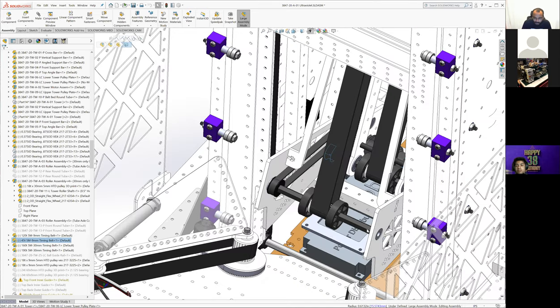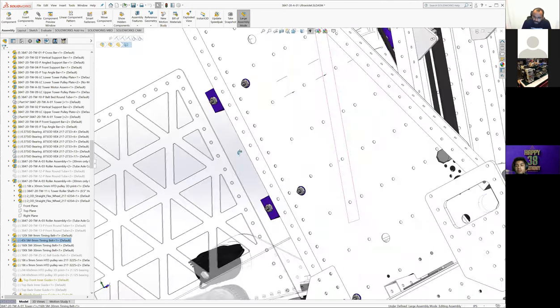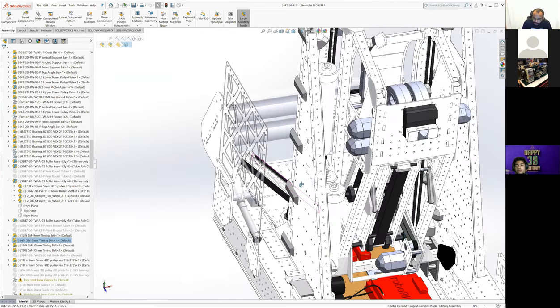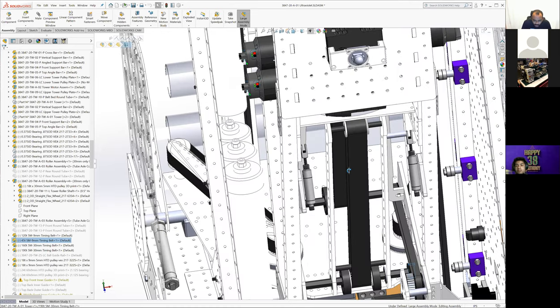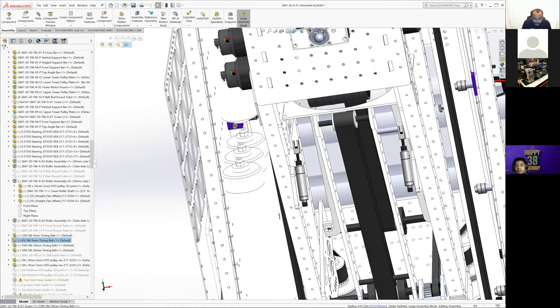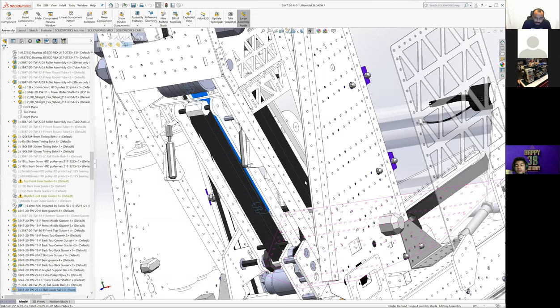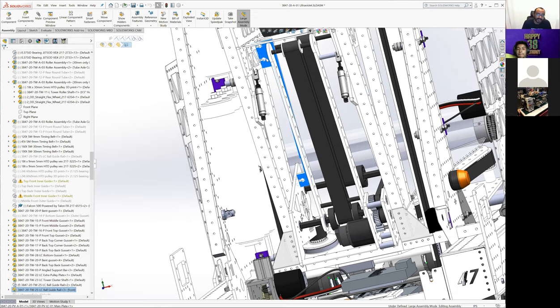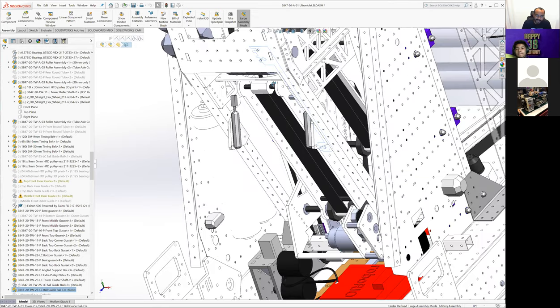Coming up the tower, the ball gets sucked in by this front roller. It rolls across the Lexan, then it grabs the back and starts getting pushed up. To be able to center the balls, basically there's four of these rails. Wait, are there? Did we get rid of the back ones? Yeah, we took the back ones out. Oh, never mind, I'm wrong. The original design had four rails. Now there are only two.